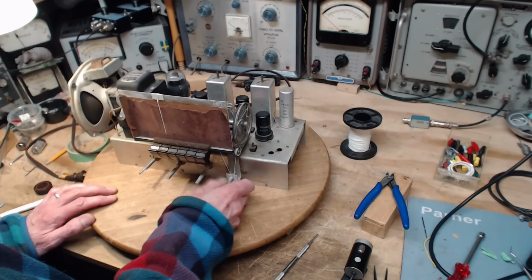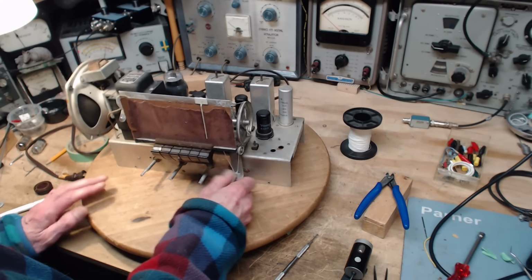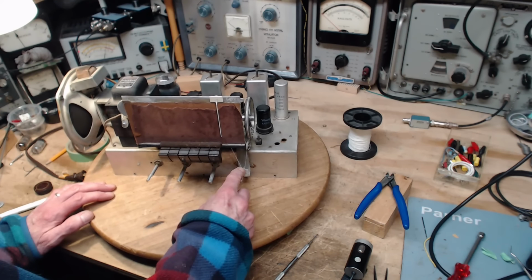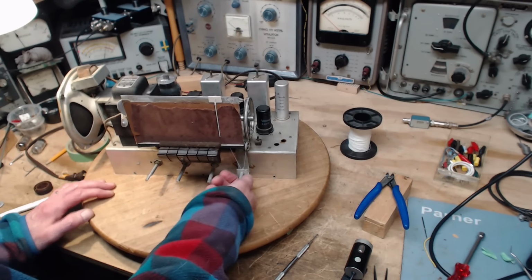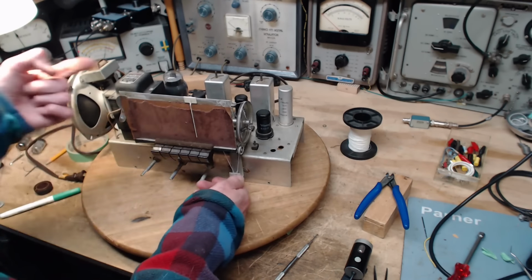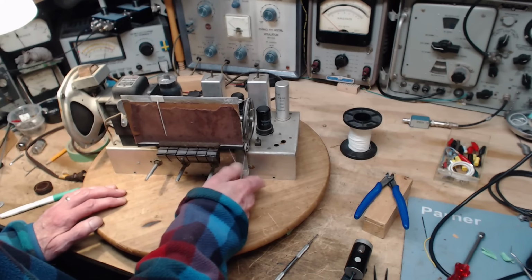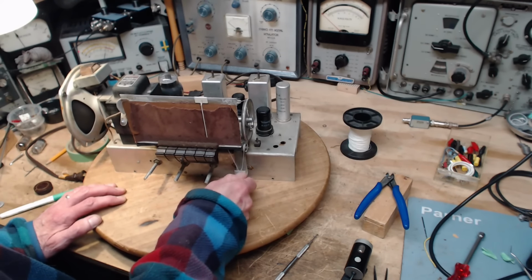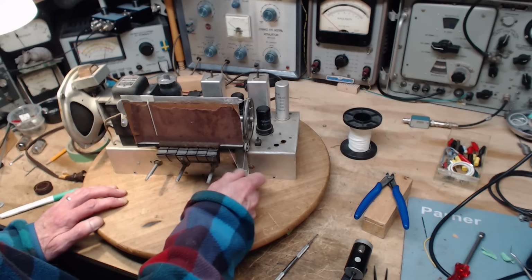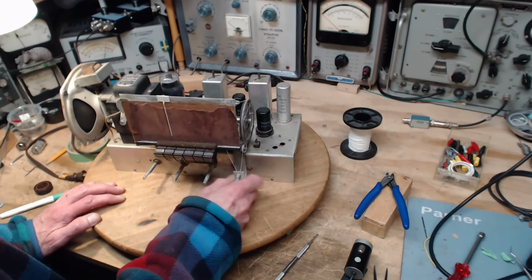And a lot of mistakes you won't realize you're making. You know what one of the worst ones is? To get this string wrapped the wrong way around the knob. So when you go to turn the knob and you hope the pointer goes this way, it goes the other way. That's very disappointing. I've had a number of radios come in that are that way. Somebody got them backwards. Well, this is not dismounting. Everything's going good.